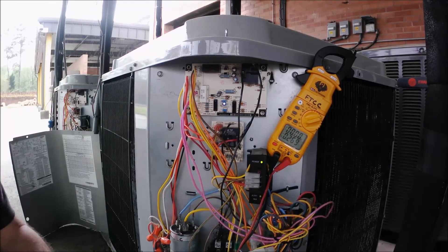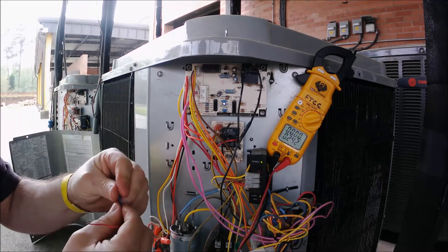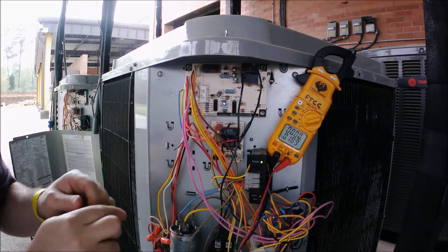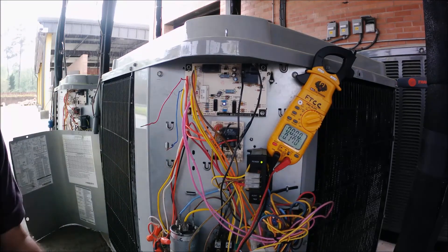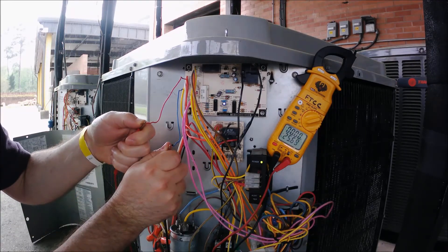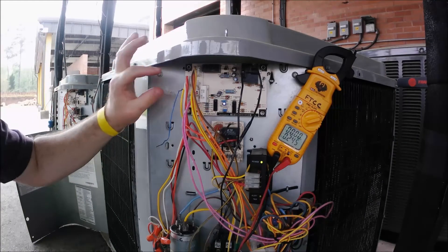Let's go over the checks. First thing you've got to do for this board to do its job is have power. I'm going to take a little piece of thermostat wire and stick it into the common at the main plug and also into the R at the main plug. This board does not have to have 24 volts on R and C for the compressor contactor to pull in, but it does have to have it to run defrost. I don't like jamming large leads in the back of these plugs — you can mess up wiring — but you can buy a lead kit with smaller ends.